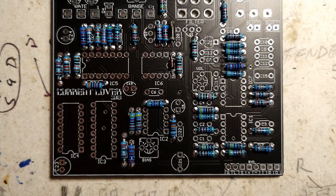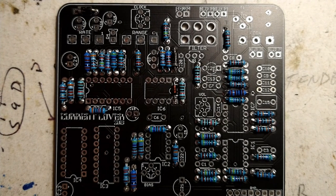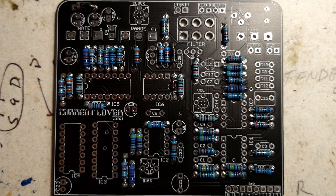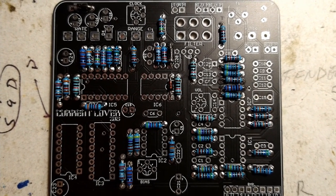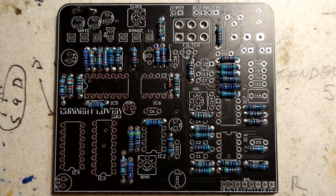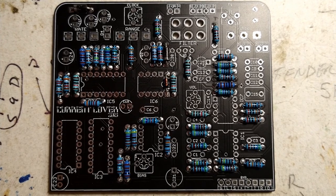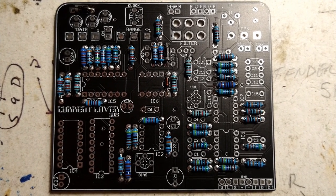And there we are. All the resistors are in place. Resistance is futile. We got rid of that 82K, replaced it with a 1K as the important update advised us to. So the tone priest is going to go eat some lunch. After that, we're going to come back and hopefully finish this up. Play some awesome rock and roll.